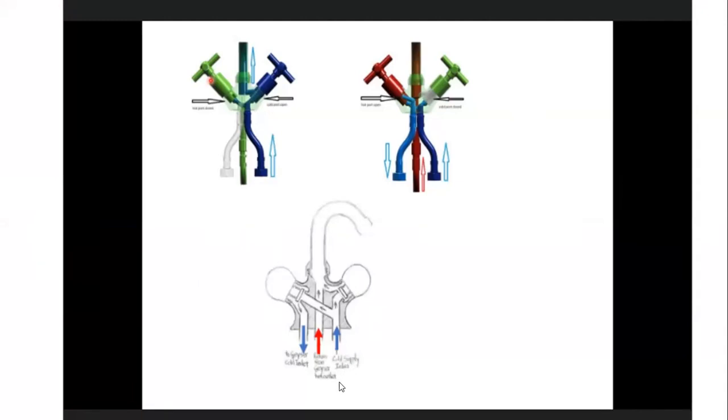A little bit technical. You can see the drawing at the bottom here. If you follow the arrows, it's very simple. On the right-hand side, we have the cold water coming in, and it's live to the head part of the hot water, and it's live to the head part of the cold water. If you want cold water only, you turn the tap on and water will flow. The head releases the water and it will flow in the normal way through the spout. You close that. If you want hot water, now this is where the interesting part comes in.